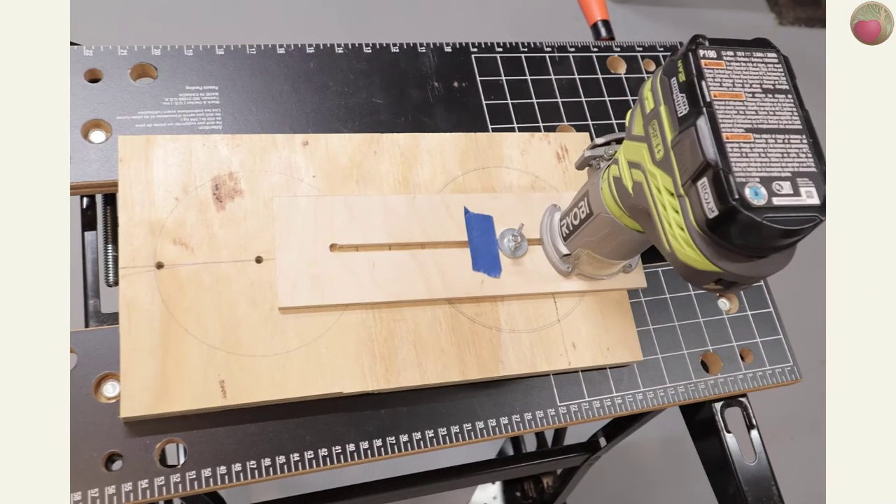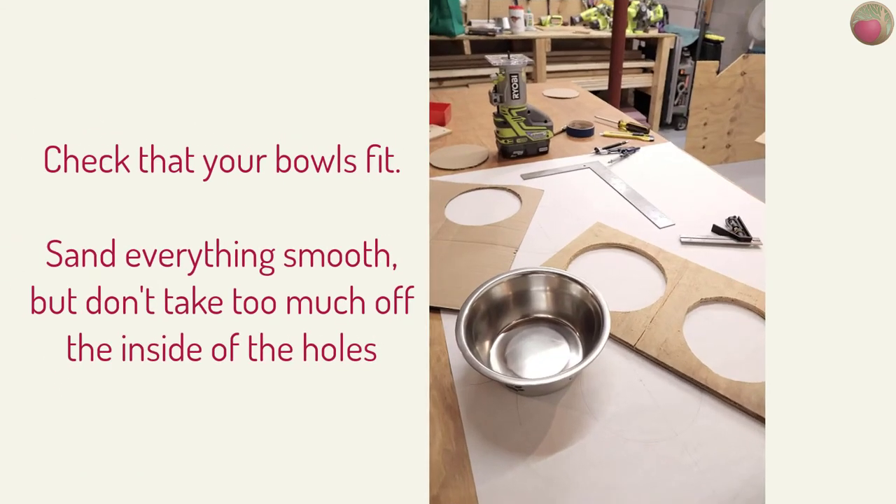Now it's time to drill the holes. You'll need four holes if you're using a circle-cutting jig. I'm referencing quarter-inch holes here because that is the size of the trim router straight bit I'm using plus the size of the center bolt for my jig — adjust your drill holes as needed. Now let's cut those holes. I use my trim router to cut nice round holes, but you can use a jigsaw — there are circle-cutting jigs for those too. Finally, ensure that your bowls both fit well into your freshly cut holes. Then sand all surfaces of the top backing board and the inside of the holes, being careful not to take too much off those holes or your bowls won't fit the same.